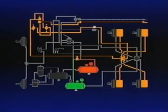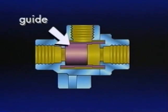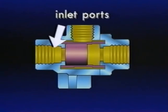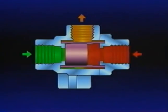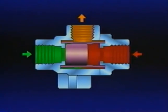Parking brakes, for instance, can be controlled from either the front or rear service reservoirs. The most common double check valve uses a shuttle contained in a guide, which is installed in the body. The DC-4 has two inlet ports and one delivery port. As air enters either inlet port, the moving shuttle responds to the pressure. It seals the port receiving the lower air pressure level, but the airflow continues out the delivery port. If the pressure levels reverse, the position of the shuttle will reverse. The shuttle never impedes the flow of air.